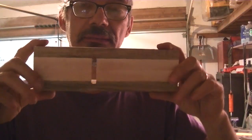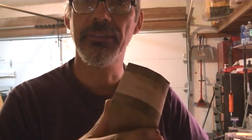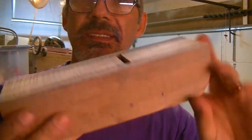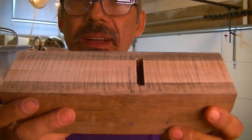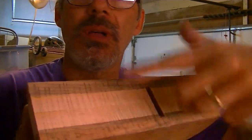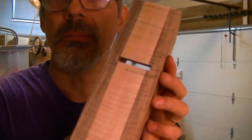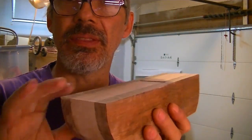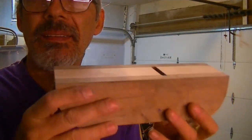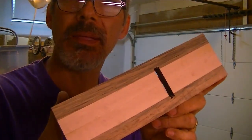I rough sanded it. Now I've got to flatten the bottom out and finish sanding the whole thing up to 400 — that's going to take me a while. This needs to be very, very flush and very straight, so what I did is take a pencil and scribble all over it. Now I'm going to start sanding on a really flat surface until all the marks are gone, and that ensures me that the surface is going to be totally straight. My bottom is nice and flat — this is down to 100 but it's totally flat. See, all my pencil marks are gone.